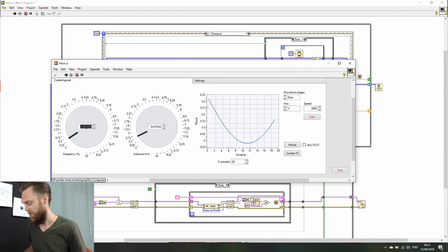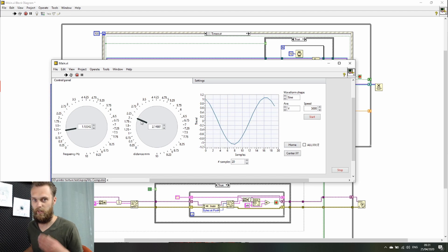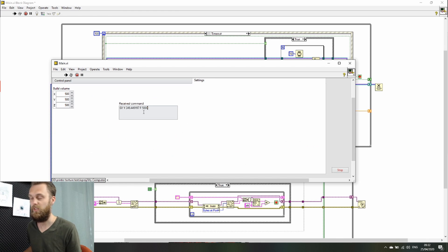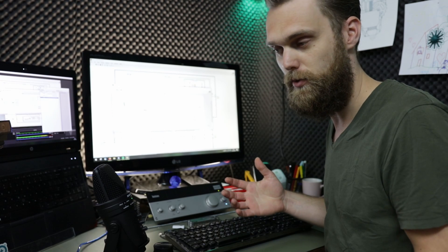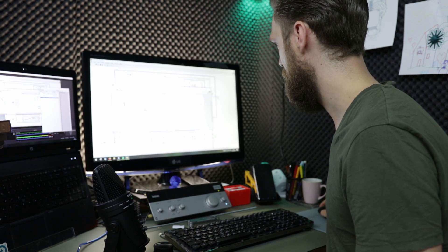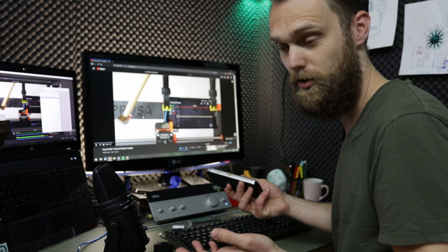If I run the software, I can set it to one hertz and it shows a sine wave. I can select several wave types: square, saw, and sine. I can adjust the frequency and the traveling distance — the amplitude. This is converted into G-code. I'm going to find the sweet spot where the resonance frequencies are. There's a nice video by CNC Kitchen, and I'm going to use his knowledge. He has an accelerometer analyzer; I have a similar app installed on my phone — I'll put a link in the description.